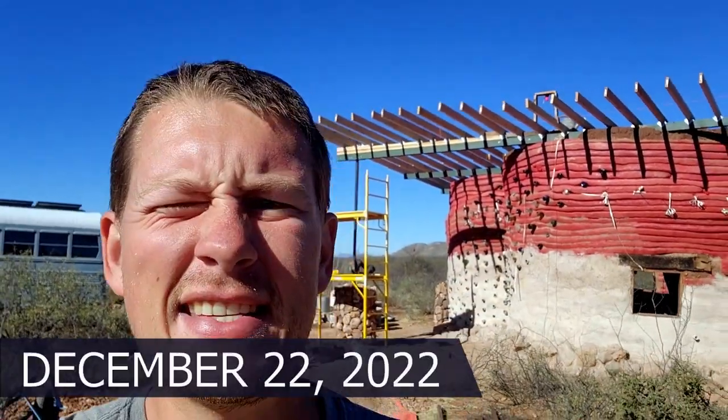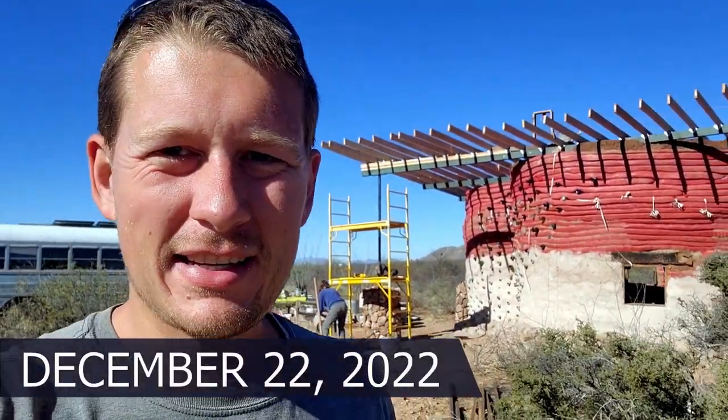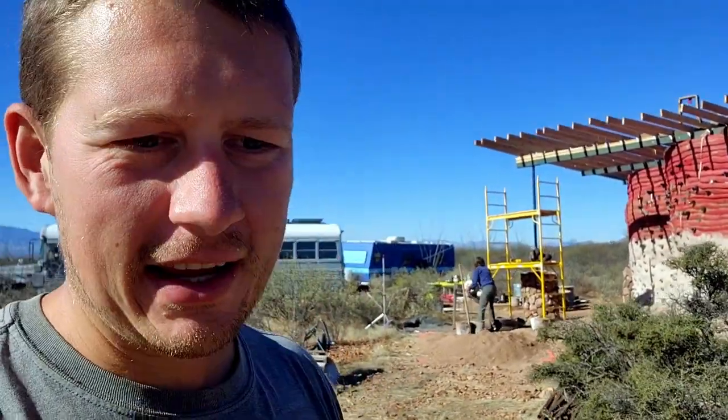All right, everybody, it is day 7 of this roof build, and yesterday was a little rough. I didn't film a whole lot just because it's kind of figuring some stuff out and kind of screwed up. Maybe you'll see right here how our rafters kind of dropped down a little bit, and I wasn't thinking. I gotta get up there today and cut those hurricane ties off. And then re-level. You may be able to see right up here, our beam was not actually straight and level and perfect. This is the first time I've done this kind of build with a roof this big. So, you know, this is why we're doing the test house, so that I can learn on things.